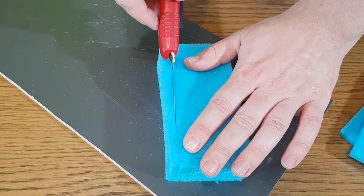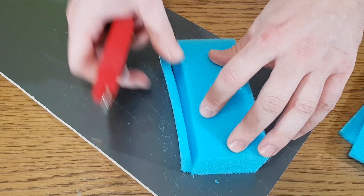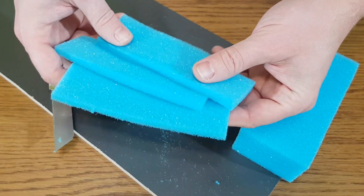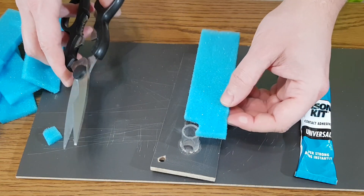I don't know what kind of power sources I will use in the future, and if the voltage is not stable enough, this capacitor will help. For the best sound quality that these speaker drivers can deliver, we need to insulate the interior. I'll use this simple sponge — I know it's not the best insulating material, but it's better than nothing. So I'll cut some thin pieces of sponge and glue them on the interior side of every panel.